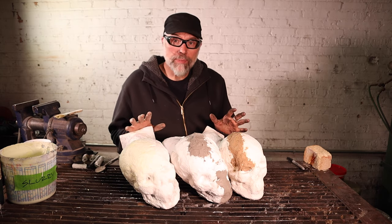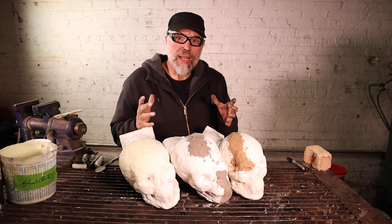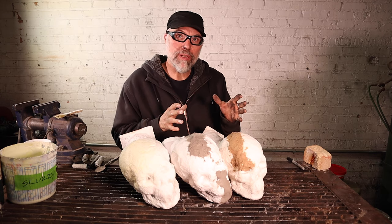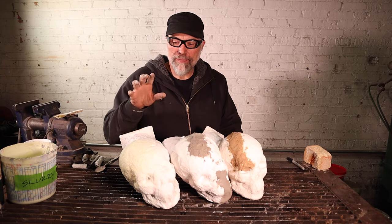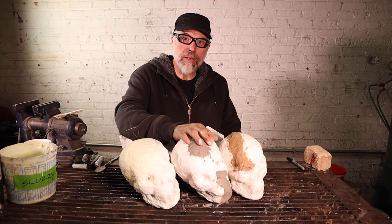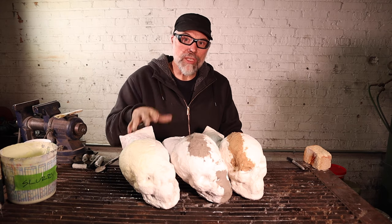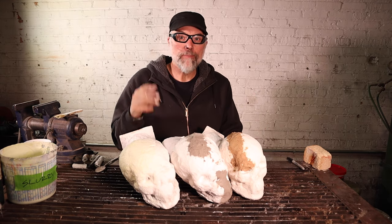So that was pretty straightforward. We have our slurry and fiberglass, our Green Patch, and our fire cement. All these products are more than adequate for fixing your shells, whether they cracked during burnout or fell off the table. I don't think I've ever had a shell break so badly that I wasn't able to get it back together and get some metal out of it. One reason I like using the Green Patch is that I can burn out, patch, and be ready to pour metal within half an hour to an hour. Whereas the fire cement and the slurry are going to take a little bit longer — either do them earlier in the day, or take care of your burnout and patching the night before and pour the next day.